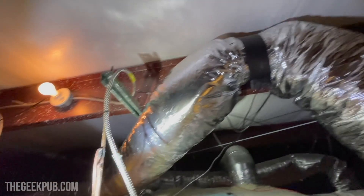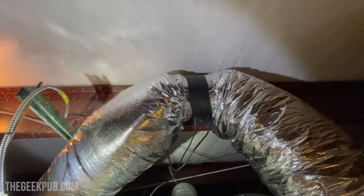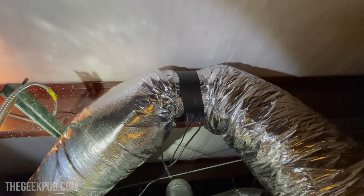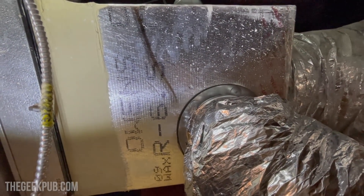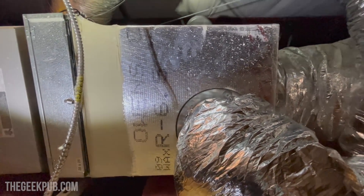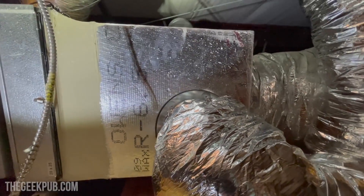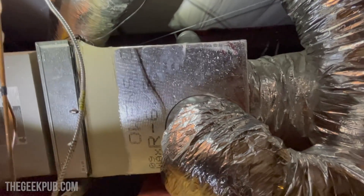Here's what I did: this is the duct that comes from the server room — the one we ran earlier — it goes up here to the ceiling, and that is the AC Infinity Cloud Line, an eight-inch duct fan rated at around 800 to 900 CFM, so it's really fast and pulls a lot of air. That duct then goes down and into the side of the air conditioning unit. I attached it to the return side of the air conditioner the same way as the return in the server room. Even when the AC Infinity fan is not running, that room will still have a return; the fan will just move air based on temperature readings whether the AC is on or off.